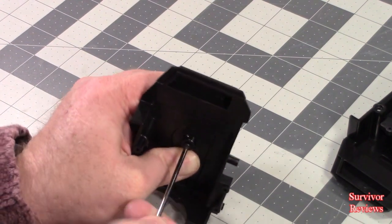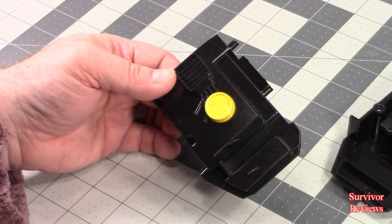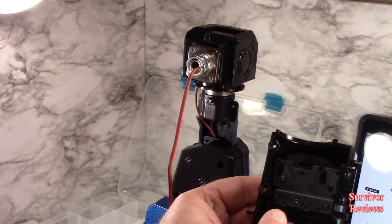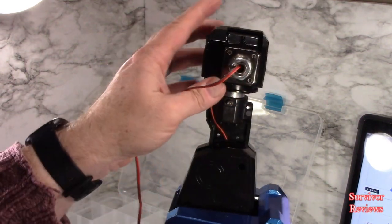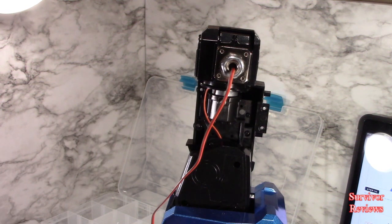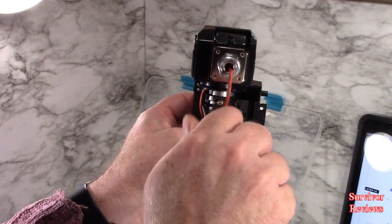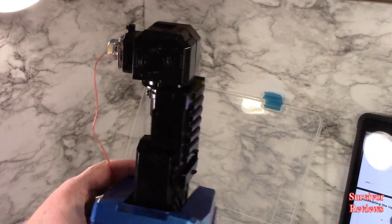Now these pieces that we just did are going to be attached to the leg. So I'm going to raise up my camera again. So now we bring in this part here that we did, okay, and it's got screw holes that are going to line up with these right here. Don't know how well you can see them, but hopefully they're lit up there. It's just going to come in and line up there, just like that. That is going to be held in place in those 4 screw holes with the screws, the PB3x8s. So, I'm not going to go too crazy doing this on camera. But yeah, one here, here, here, and here. And that's what it looks like secured to the side of the leg.